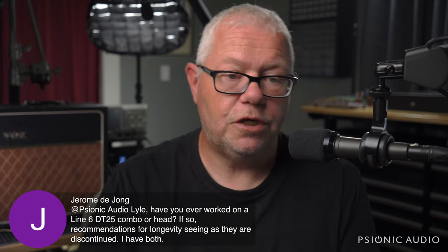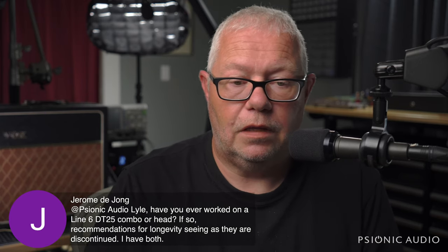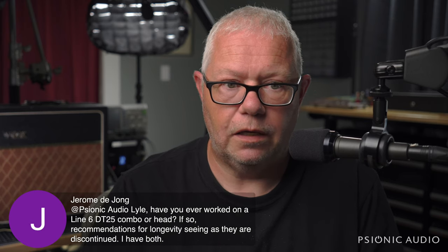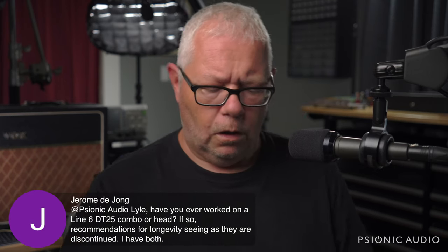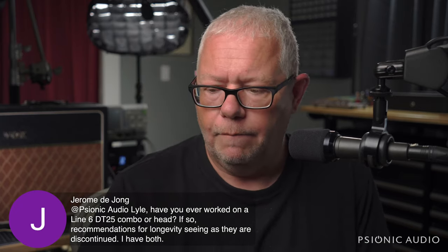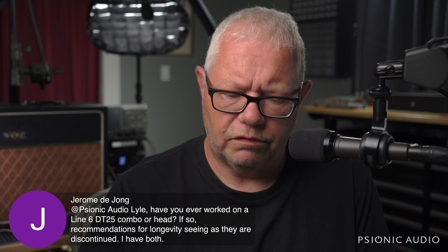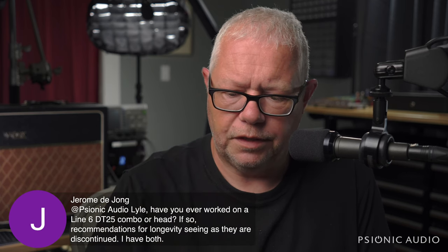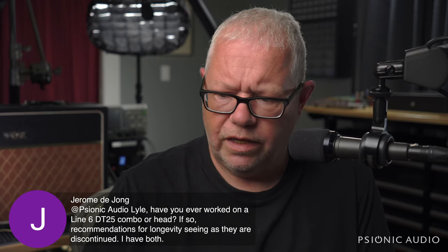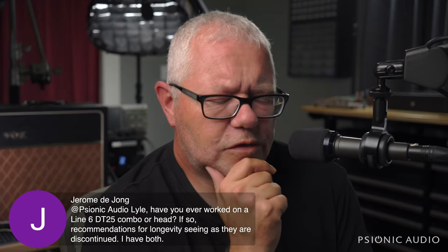Hey, Jerome DeJong. No, I've never worked on a DT25, sorry. I've had very few Line 6s come in on the bench because most of them, when they die, die hard. So they're not fixable or economically fixable. I've had a couple of Spiders come in where I was able to give the kid a few more years of life. One electrolytic blew up and it was easily accessed, so I changed that out. Once I had to change one of those rotary sensor things on a, I don't remember if it was a Spider or what it was.